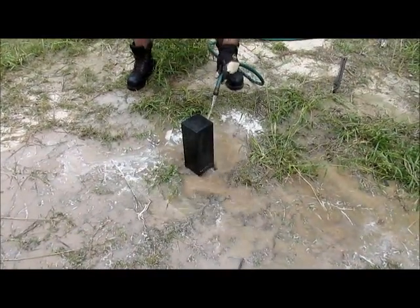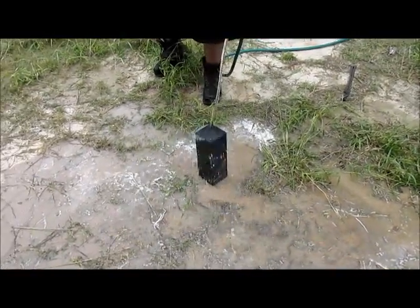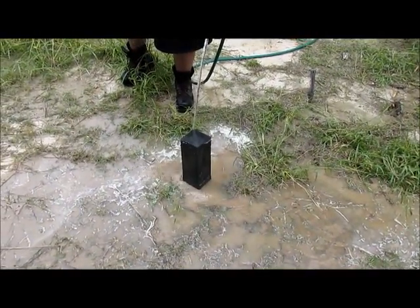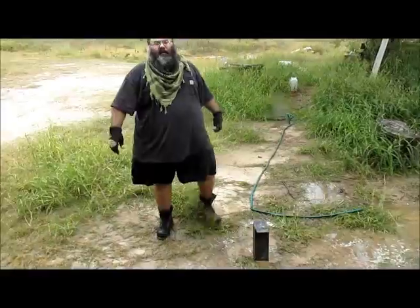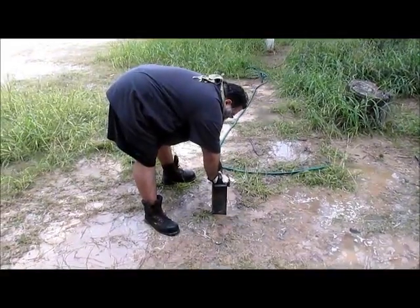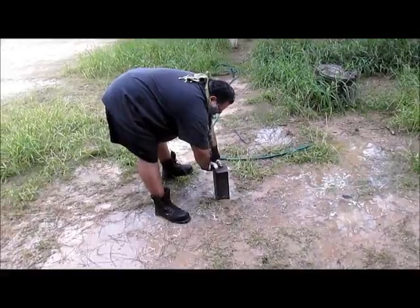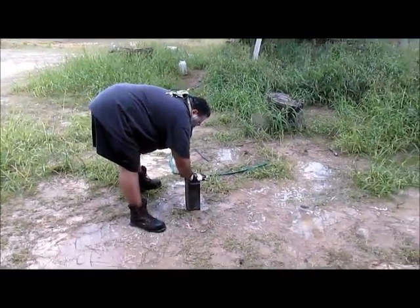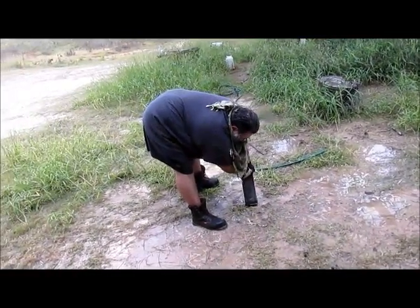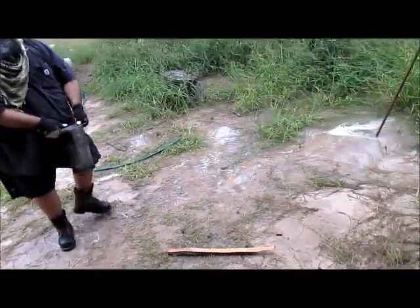It's got everything you could want in a regular little stump anvil. It's got the temperature down. I don't think we're going to have to temper, but I think we ought to for safety. So basically we probably came in a little over that transitional curve. The face is pretty cool already but it's still warm at the bottom. I think we're good to take it into the kiln — this will do a stress relief.